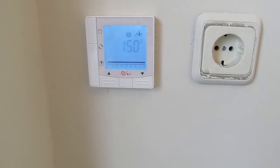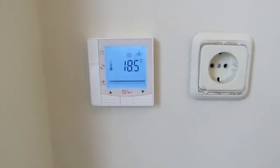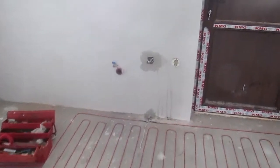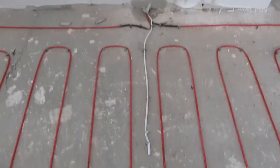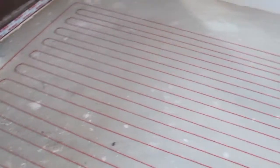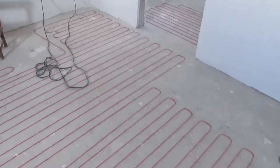Let's do a recap. We don't necessarily place heating cables under heavy furniture, and that's why you can see some spots which are not covered. It is important to calculate the electric installations and breakers for each room and the required power for the heating system.